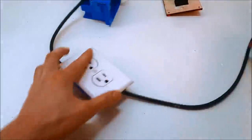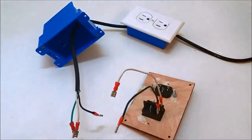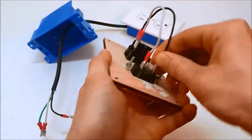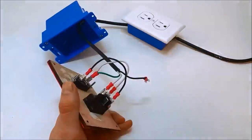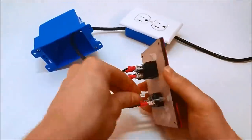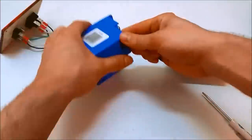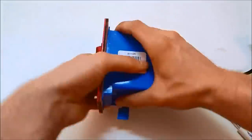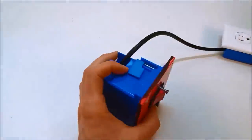And with the new work box, we're just gonna wire the plug receptacle to the switch, connect ground straight to the plug receptacle, and just the power for both poles, hot and neutral. And then that gets tucked into this box for safety reasons, since it's 120 volts. Those connectors aren't being insulated, so we'll just stick them in a box, hopefully to keep wandering fingers away.